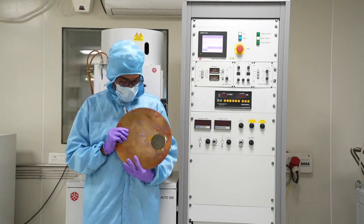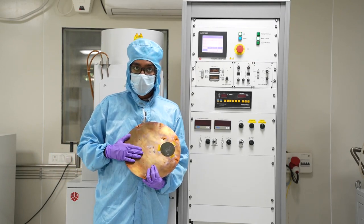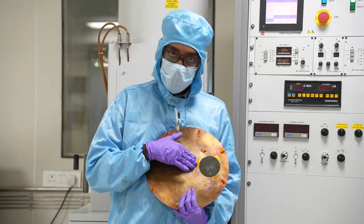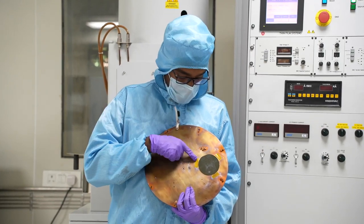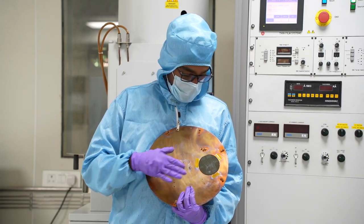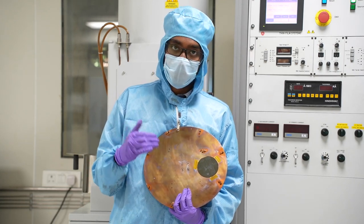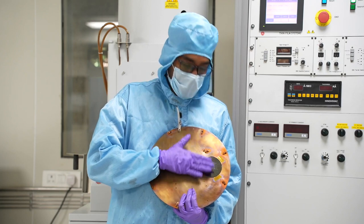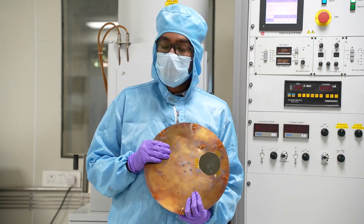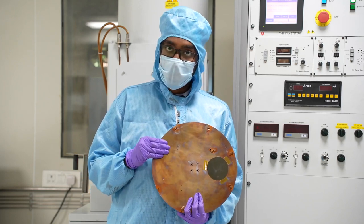Here if we see — last time when we showed this, this part was kind of clean. After deposition, you can see the material has been deposited on the chuck as well. The wafer got the deposition and this area too. Here, what is the structure as of now? On the silicon wafer as a support, on top of it there is polyimide, on top of that the photoresist layer, which was patterned by lithography. On top of it, we now have a deposition of titanium and platinum. This is the structure. After each deposition, our chuck will look like this and we have to clean it.